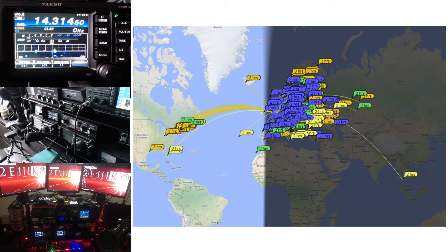No need for an ATU. I've not had to use an external ATU — I don't think I've had anything over 2-to-1, really. It probably averages 1.7 to 1.5 SWR through the spectrum — the spec of the BB6WS, which I think is 2 to 30 megs.